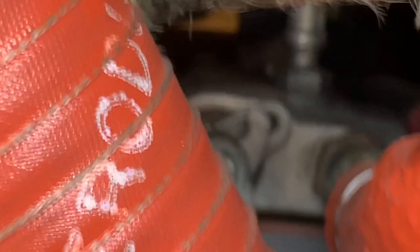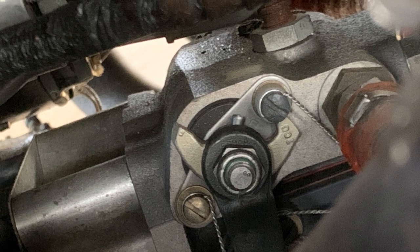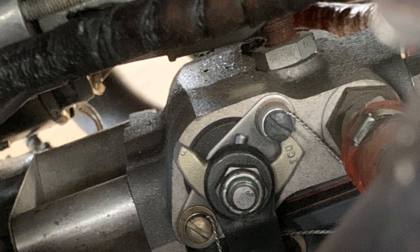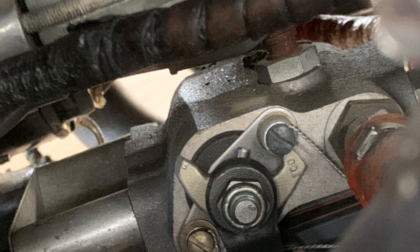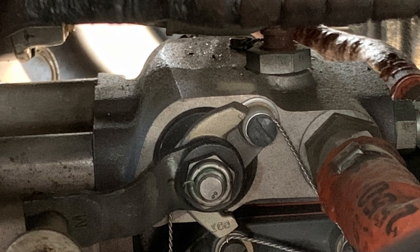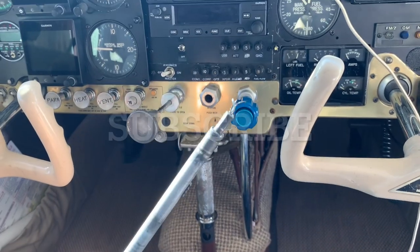Here's the good unit with the screw, the bushing, and everything safety-wired. One of the reasons we need to reach out to the Bendix-approved overhaul facility is I don't know if going past the stops can actually damage the unit. We'll have to ask that question and then determine what part numbers are supposed to go in the hole, whether there's a torque spec, if it gets any kind of Loctite, or things like that.